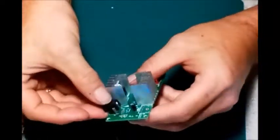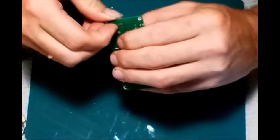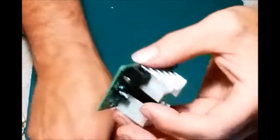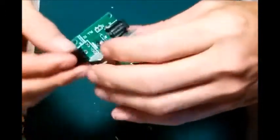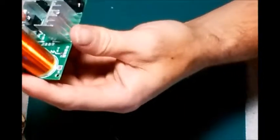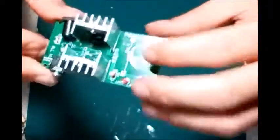These things are pretty easy, fairly well self-explanatory. We have the power socket, so that's going to go right beside it. And for the headphone jack, same thing - just going to bend one over on each side just to keep it in. Now I'm going to get this stuff soldered in first, then I'll deal with the coil. We have two coils - the secondary which will go on, and then the primary which I'll have to wind around it.